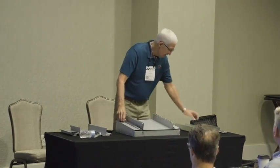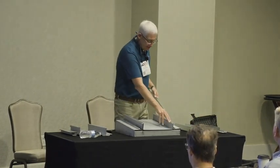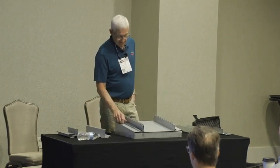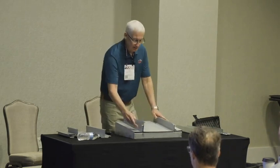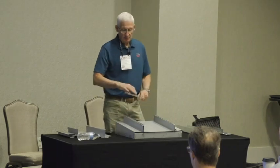And then you've got a seam cover. You have 2 pieces of sealant in the seam cover. The sealant sits out here on top of the panel roof. There's no interruption in the sealant. These other panels have an interruption in the sealant wherever there's a clip located, unless you put a whole bunch of goop on top of the clip when you're installing it. So then you have a cap that goes on, down, and the seamer runs up.